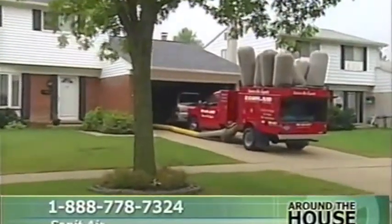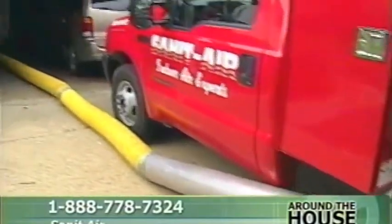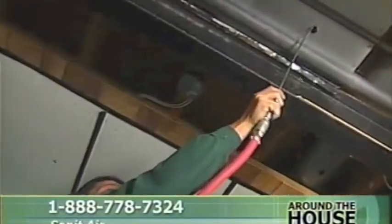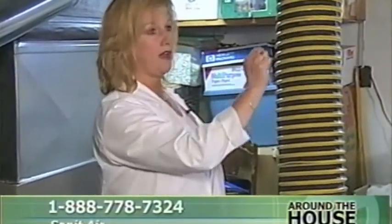Sanadair uses a big truck-mounted vacuum that pulls at a rate of 15,000 to 18,000 cubic feet of air per minute and uses a push-pull method. Environmental scientist and owner Connie Morbach explains: as we're pulling from one side, we're going to push from the other. Regardless of how powerful this truck is, we're not going to pull debris from 20 feet away and around a 90-degree turn — we have to actually get this debris to the vacuum from upstairs.